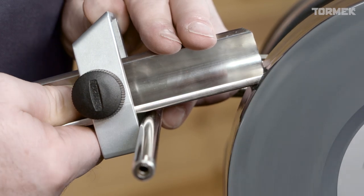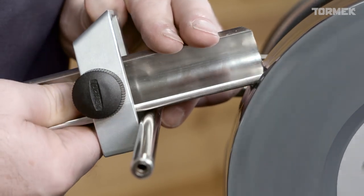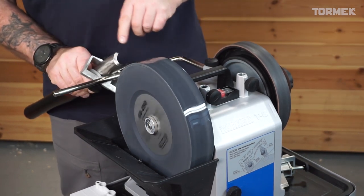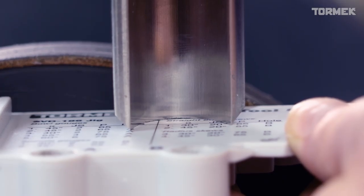You would have seen that the last part of this is much more fluid, and there was a slip in the middle of that. If the roughing gouge is sharpened correctly, you should have no more than the tip of a pencil visible through a space, so you have a straight grind across the face of the tool.